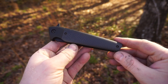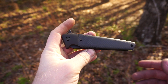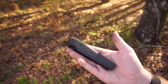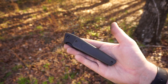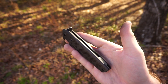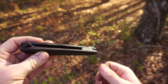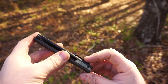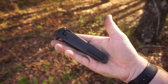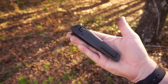This was the knife that put Moon Knives on the map, pretty much. What I came up with was a bolster lock knife. Bolster locks have been done before — it's not unique to my knives. But what is unique to my knives is the taper on the frames. It tapers from being very thick here at the bolster to being relatively thin on the butt, and that basically makes it feel a lot slimmer in the pocket. The Mark VI kind of took off. It was very popular and still is — it has kind of a cult following.